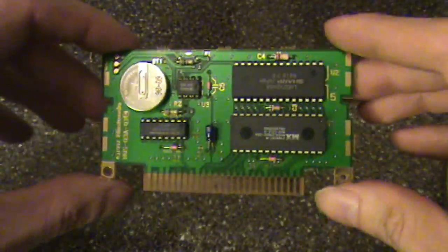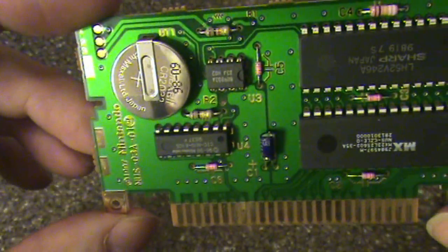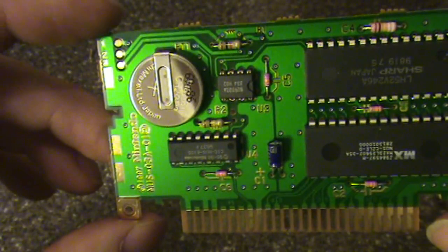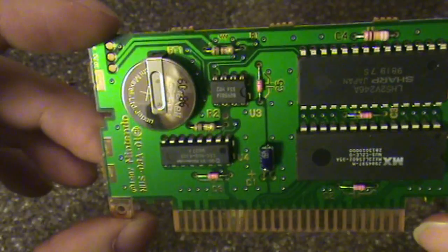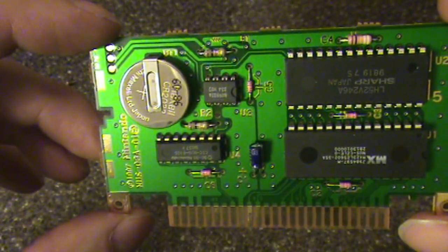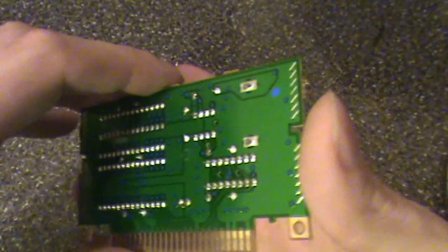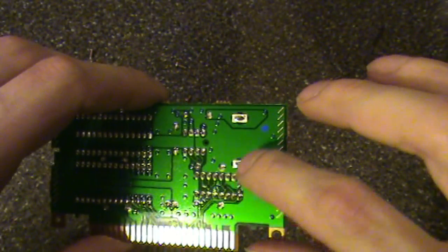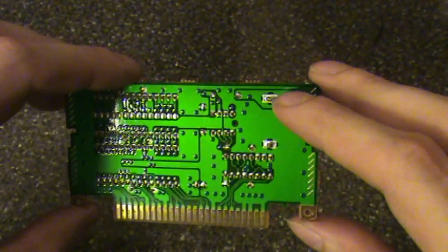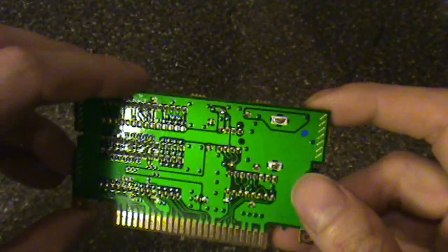This is the component side of the circuit board — it has all the chips and the battery on it. You can see the battery right there in the top left corner. Let me plug in my soldering iron to make sure it's ready when we need it; it takes some time to heat up. As you can see, the battery has a date on it. This game came out in November of '98 when it first came out, and this battery looks like it says September of '98. Now we're going to have to remove this battery and replace it. This is the soldering side of the board, and you can see it has two solder points for both the positive on top and the negative terminal on the bottom.